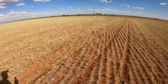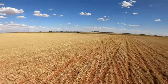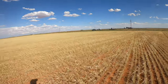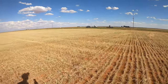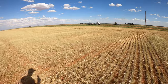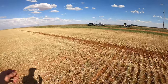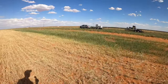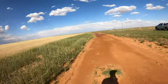Just when I thought we could start planting, my tractor doesn't want to work. Luckily it only stopped here at the end of the field. Basically there's a sensor for the hydraulic filters that keeps going out — we've replaced it a couple of times already. It beeps like crazy telling you that the hydraulic oil flow is restricted. We just have to go buy a new sensor, put that on, and we should be good to go. I'm hoping we can get John Deere after-hours to quickly get us another sensor.